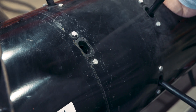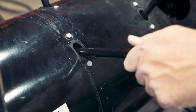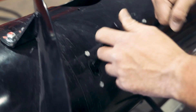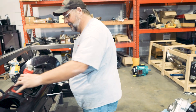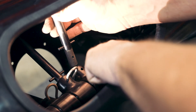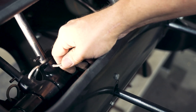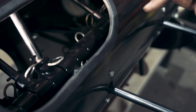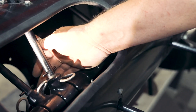To install the finger, you have to go through an access hole, get your arm in there, and install it from the inside out. Get it lined up — there's our finger through the hole — and now install it in the finger holder and put a clip on it. To do this on an actual combine header is fussy because you can't get your arm exactly where it needs to be. Insert the finger, line it up with the finger holder — notice there is a spot to align — and then put your push pin in. It's recommended to put the spring clip in so it's going in the same direction of motion; that way if any debris gets in, the clip will try to push itself through. If you put the clip in backwards, debris could get in and cause issues.